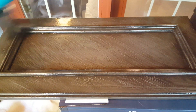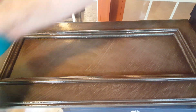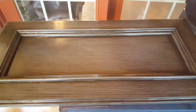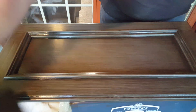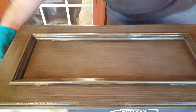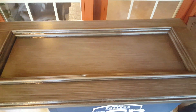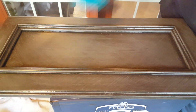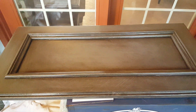We're going to start again with brush number one, going diagonally one direction, clean it off, diagonally again, brush off, across the grain, clean it off, and then go with the grain. Hit your edges, going in a downward motion on the edges the first couple of times. Make sure you get them all covered. That's basically brush number one — then grab brush number two.